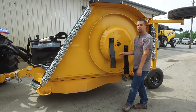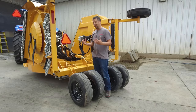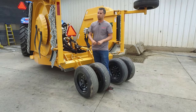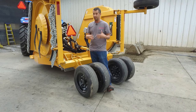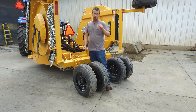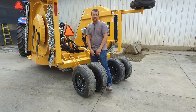Really some unique applications that we get into with this equipment — they're going to call for things that you may not see in an everyday application. Continuing on our airline theme, the tires on the back of this are actually also airplane tires. This is an option on a lot of rotary mowers like this where they actually will buy tires coming off of small aircraft that can't be used on the aircraft anymore. For a mowing application, they're really ideal. These tires can be, say, 18 and 20 ply — very thick with a lot of rubber in them so that they're not apt to go flat on you during a demanding application.